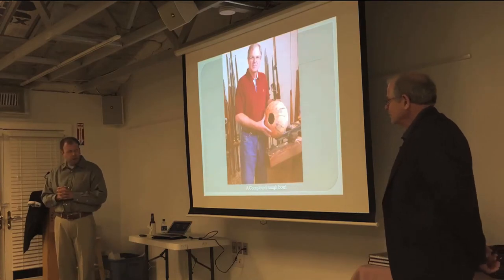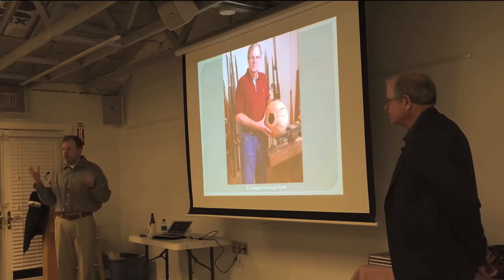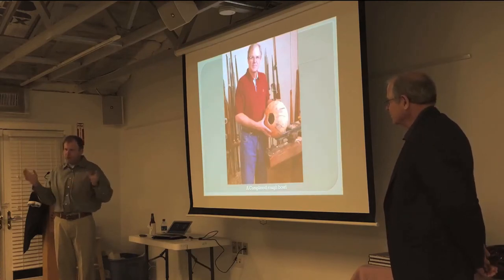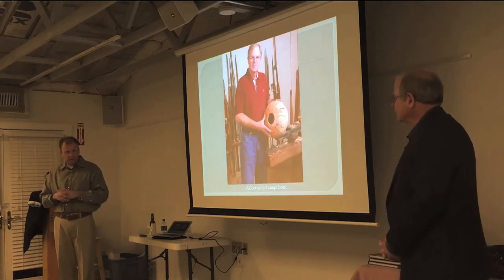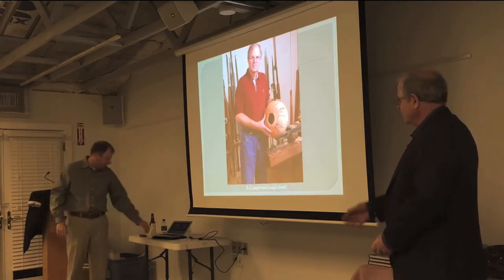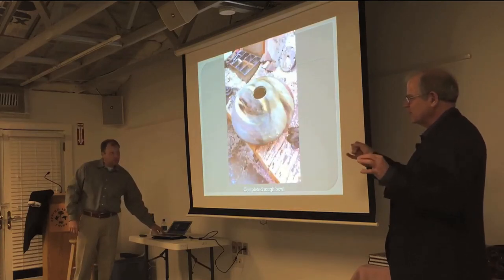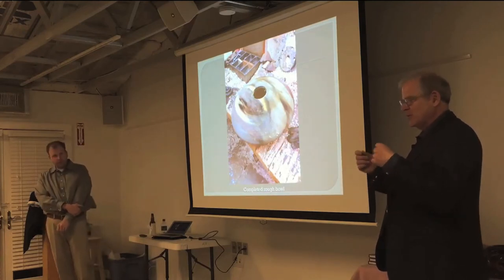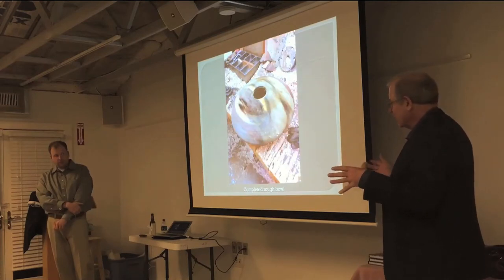And it has to do with the moisture, because there's a lot of science involved with what we do, because of the wood being a living material. It's full of moisture, and so it expands and can contract, and so we have to be conscious of that. And there's cracking and drying, so we have a process for it. Most of the wood we use has a lot of moisture. In fact, the day it's cut, we can actually turn the bowl out of it, so we don't have to wait for it to dry. A lot of people wait and use dry pieces, but we don't have to do that.